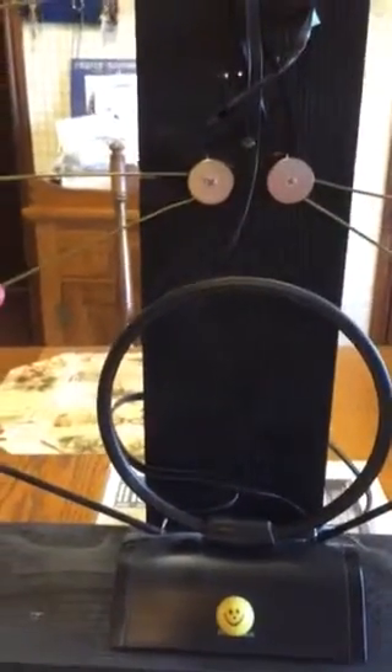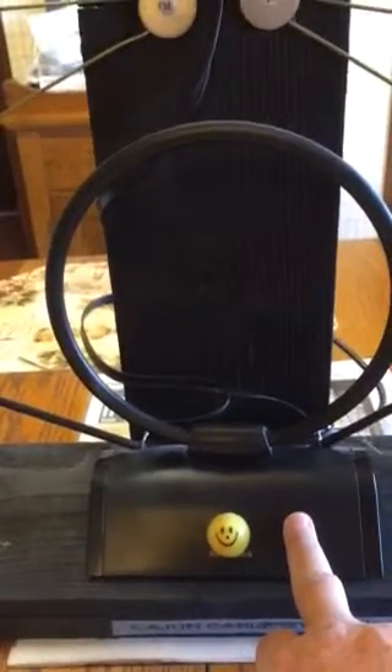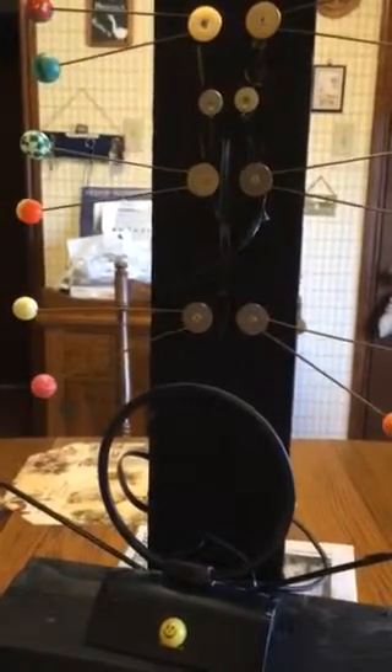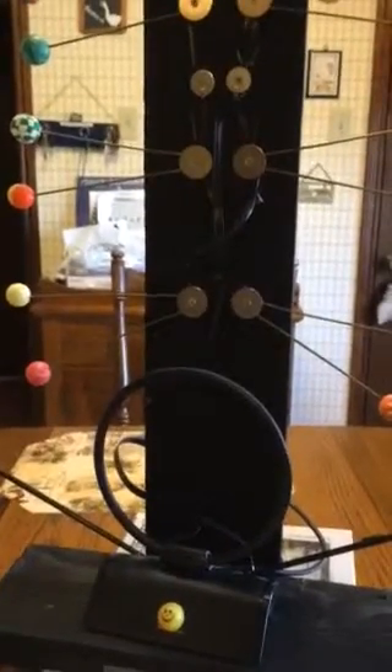To give it a little extra power — I know before you started messing with this stuff you went out and got a small tabletop unit to hook your TV to, and were dissatisfied with the results. That's why you started playing with this. Just use that unit as a booster to increase your signal. Unscrew the antenna lead, plug in the wire to the middle to collect the signal, and when you power it up it amplifies it. I live 60 miles from New Orleans, so I didn't expect much — according to all the charts I was out of range — but I was still able to get three New Orleans stations.